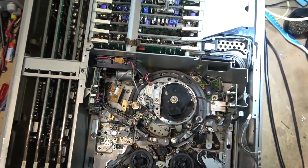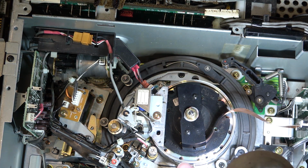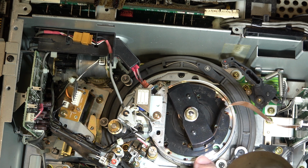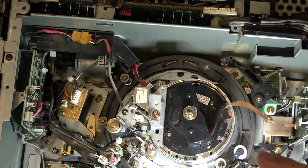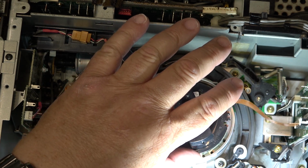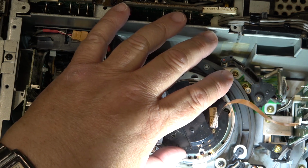The analog machines record separate chroma and luminance tracks, so there'll be 2 heads side by side, which there are. And it says playback. That'd be a chroma head. Playback. Playback. Yeah, there's tons of heads on this thing. Can we count them all? I think I counted. What did I see here? Oh man, this thing's got so many heads on it. Unbelievable. There's even more than I could spot initially.